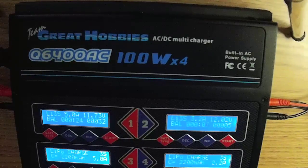The first part of the charging process is constant amps — it will charge at the amps you selected and stay at this until the batteries reach 12.6 volts. Charger one is at 5 amps and charger two is at 3.2 amps, with voltage slowly increasing. The second part begins when the charger reaches 12.6 volts — voltage remains the same and amps drop. The third process happens during the last 5% of the charge: the charger turns off and on internally to put the last few amps in. Once amps drop to about 0.2, the charger shuts off and charging is complete.